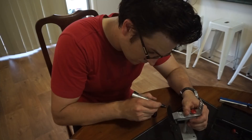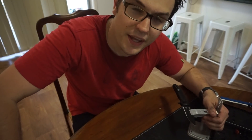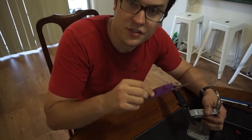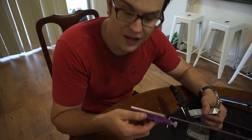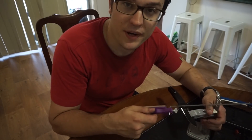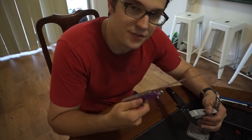What I'm going to do now is try with different types of edges. I'm going to go toothy edge, which is often what people say you should use with high hardness steels. That means just finishing with a fine diamond stone and not going full polish. What I'm doing is resetting the edge, making sure I just do up and down strokes rather than any polishing motion, and I'm going to stop after the fine diamond, which is probably about 500 grit. So it's not going to be a mirror polish, but it should be a more jagged micro edge. We'll see if that helps.